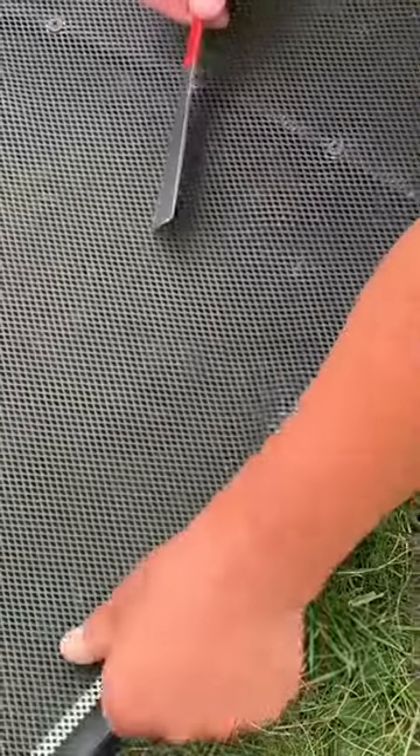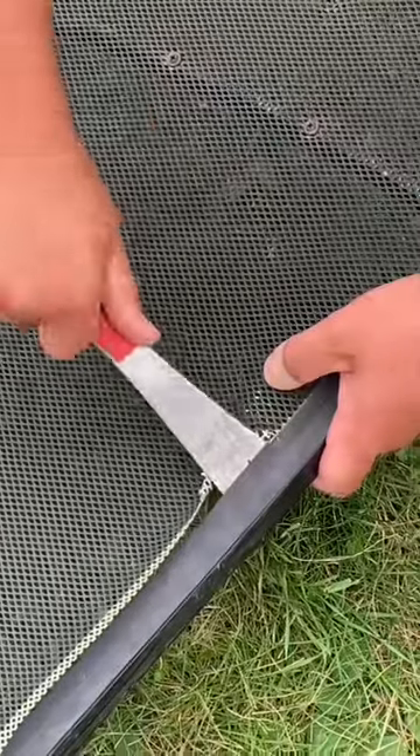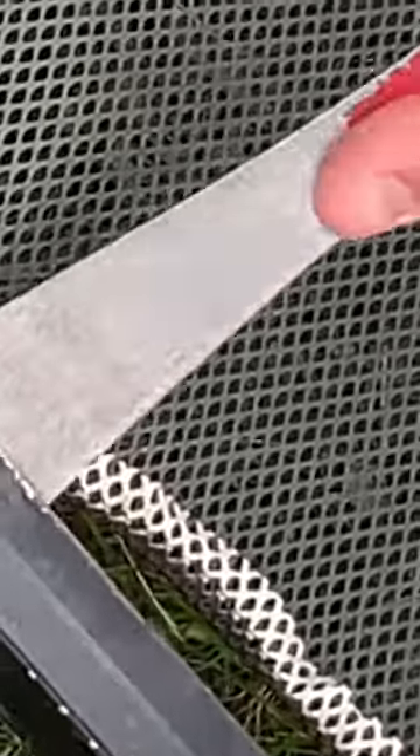Here's how to fix the mesh panels that have fallen out of your C-band satellite dish. This can be done with a flat pry bar or a flat screwdriver. Just carefully pry the ribs on that metal frame up very carefully. Don't pry it up too high though, because you could cause metal fatigue and possibly break it.